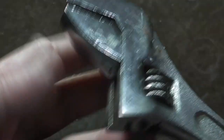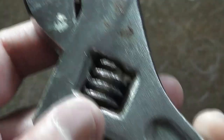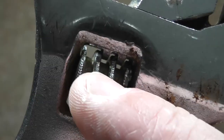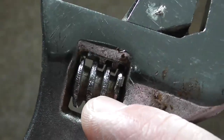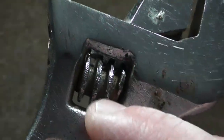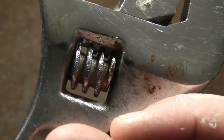It's just about as tight, which is surprising. We can see the broaching, at least on this one, is actually pretty well centered. If we look here, we can see the teeth on the moving jaw are just pretty straight. We can see the teeth on this wheel are pretty straight. This wheel is really beat up, surprisingly so. That wheel is probably mild steel.